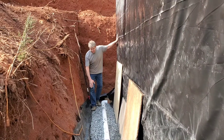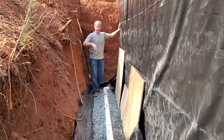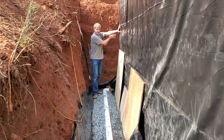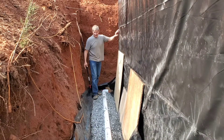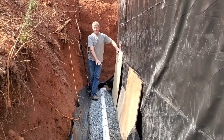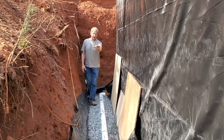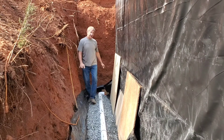Got this plastic on the wall. There's a trench all the way around the house — it drains from this side all the way out the front of the other side. I've laid the fabric in the trench and put some stone down, roughly around two inches of stone. The pipe's sitting on that and it's draining this way.